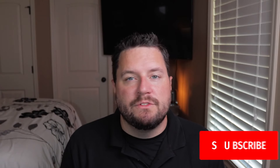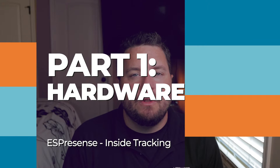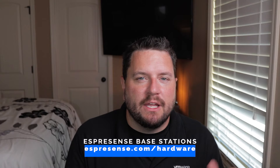Tracking phones is limited to devices you have direct control of — where you can trust putting the Home Assistant app or a third-party Bluetooth beacon app. As far as hardware, you need some sort of ESP32-based device to do the tracking. These are the D1 Minis I got off Amazon — they come in a four or six pack and are available for Prime shipping. There are also cool devices by Matrix 5 available from DigiKey that don't require an enclosure and run off USB-C with an onboard infrared LED. The developer has a dedicated page showing compatible hardware, with a link in the show notes.